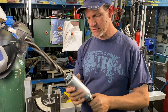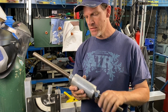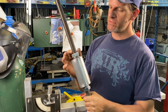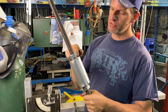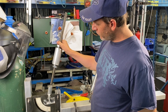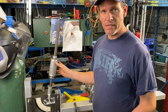Now that we have our headstock all turned up, I pressed the bearings inside and put it onto this threaded rod. This threaded rod goes into my frame jig and uses tapered bolts that I made with this one-inch threaded rod. It tapers into the bores of the headstock or the bearings and lines it up with itself. We can put this into the frame jig just like that — it's adjustable up and down to whatever size you want.